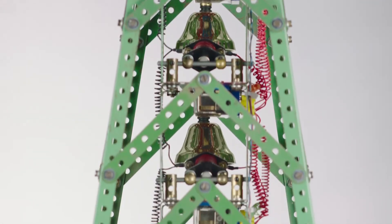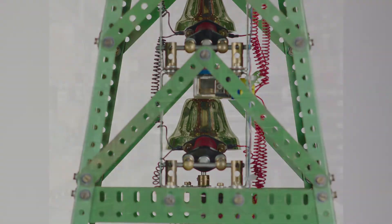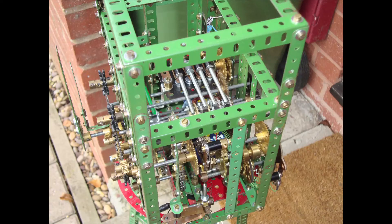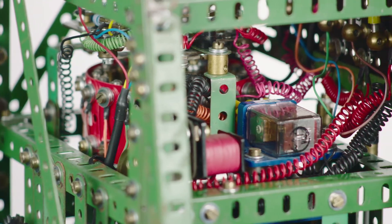The chime was kind of tricky, but in simplistic terms there are four cams — as you can see here, one for each quarter — and they then close a contact in series with a further contact which will close when the minute hand reaches the zenith point. These then trigger the drive to the uniselector.